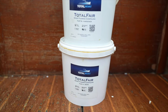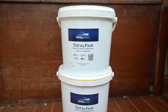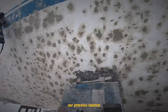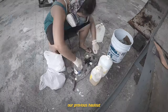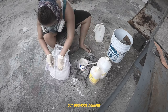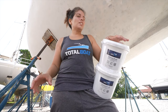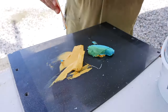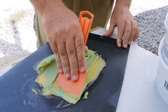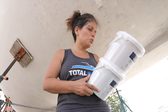The first material that we're going to test out is the epoxy fairing compound. This makes it quick and easy for us to fill in and smooth areas where usually I'd have to mix two-part epoxy and then mix in the right mixture of various dry compounds. Now this should just be one flat surface, one plate, one spatula — mix one and one part, avoid breathing the vapors, wash hands after handling, store away from heat and keep cool.